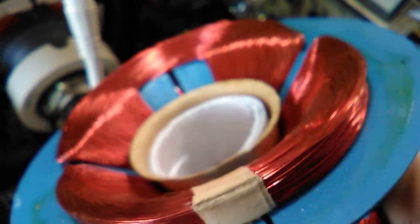So, anyways, I have this other deflection coil. It does not seat up to the picture tube properly. It's a different shape. This one here seated good. It just had to have that cardboard, which is original to the deflection coils, but the paper obviously I shoved inside there. So let's see what happens with this one. I'm going to watch the boost voltage carefully, I guess, and see what happens.